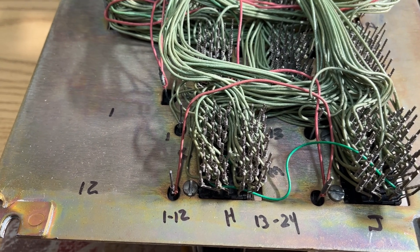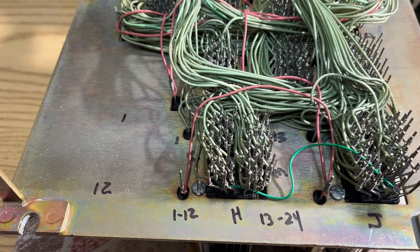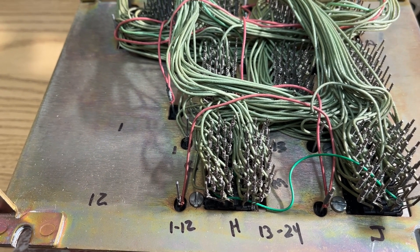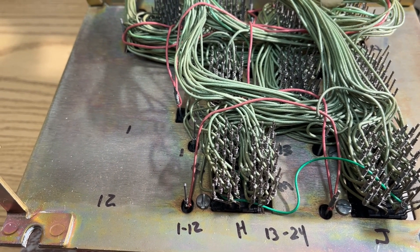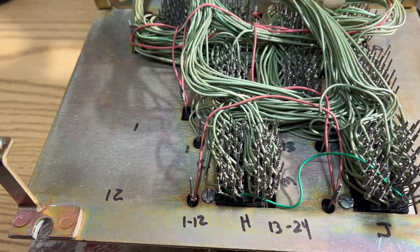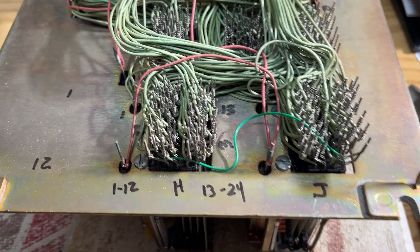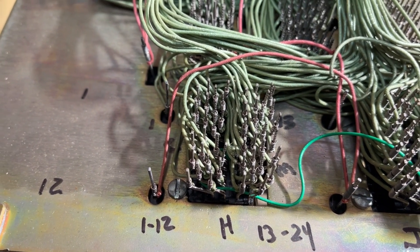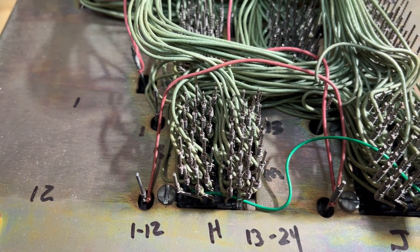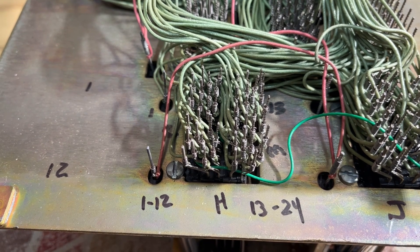I had the new relay in the KTU mounting and have all of the wires tied back down where they go. I had one wire in the wrong place, so I had to trace that out and move it to the correct terminal. With all of the leads placed, on this particular relay everything is in open contact, and the springs on the right side of the relay all go into a kind of harness up to the screw terminal board, so buzzing those out was actually quite easy.